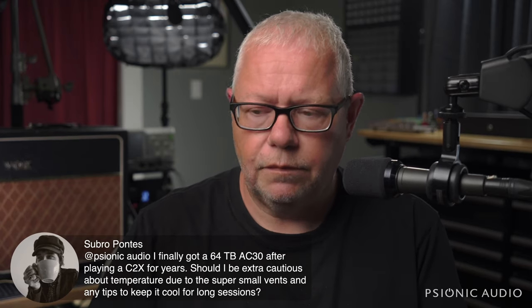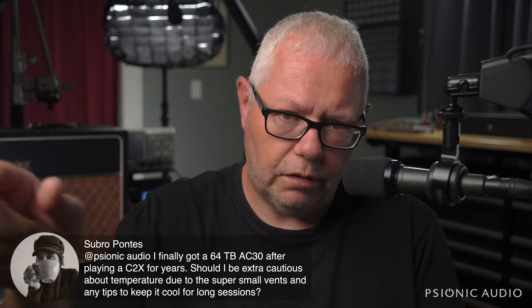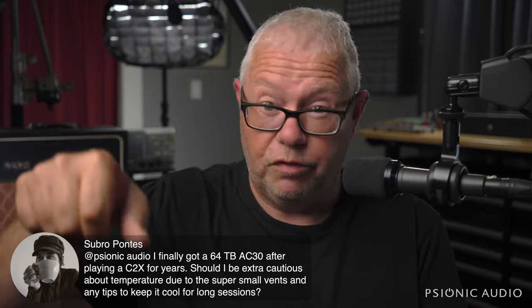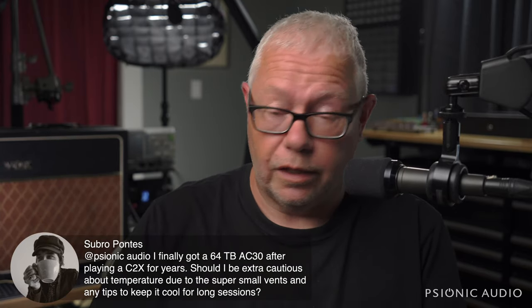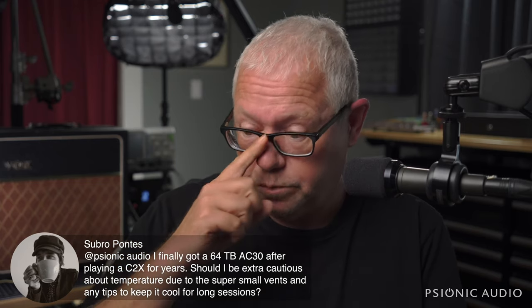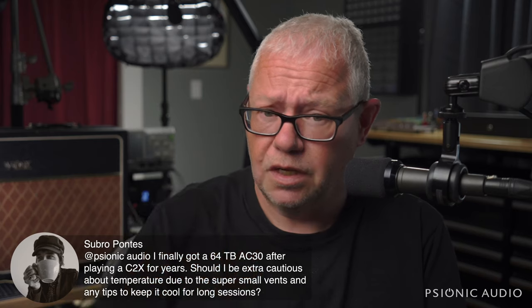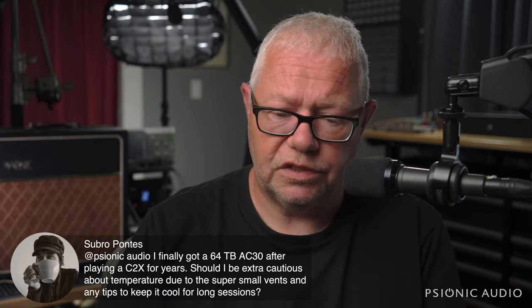So you can do it with a variac, you can do it with a brown box, you can do it with the offset like that. Though with any old JMI, those voltage selectors are very fragile. I usually have people choose a country to use it in and let me hardwire it to that voltage. Leave the switch mounted for external cosmetics. But it was fragile in 1964, and it's really exceedingly fragile today.